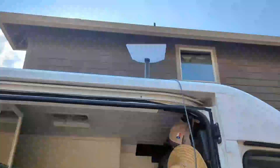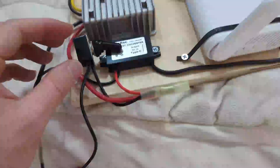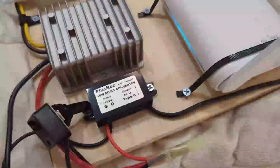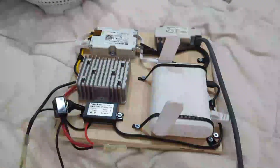Let's see if the Dishy moves. Okay — it's moving. It just moved. No way! This is going to take a minute to get some service. So here's a recap: I've got a switch on this one. The power comes in, does 12-volt to 5-volt for the router and 12-volt to 48-volt for the PoE, with the plug-and-play Dishy connector. I just got this router, so I'm going to give it a few minutes and show a screenshot of the app connecting and the speed test results.